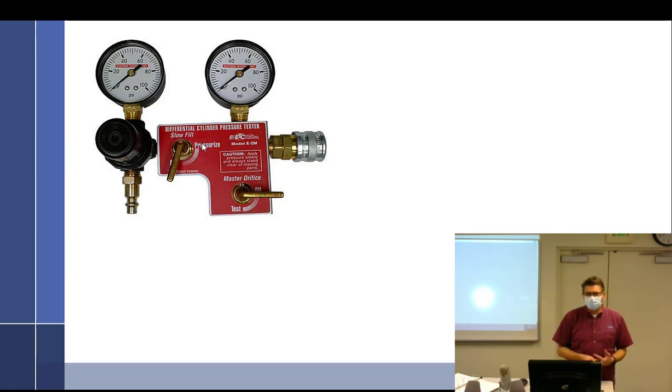And we'll just say, let's say anything 70 over 80 is better. Well, it used to be that way. It is more for Lycoming. And if you use 4313, they follow suit. But Continental is so different anymore. And this is actually a differential tester that's because of the way Continental does stuff.